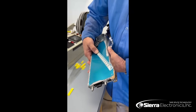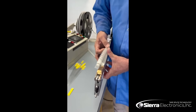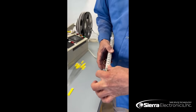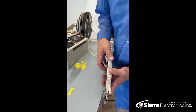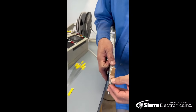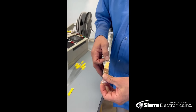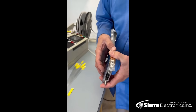Today we're going to be showing you how to feed a 16 millimeter SMT feeder. We will pop this cover open where the sprocket drive holes are located, feed this through there right into the front housing, push that through, and line that up on the sprocket drive holes itself.